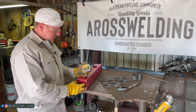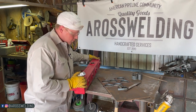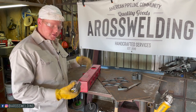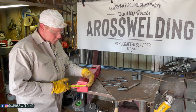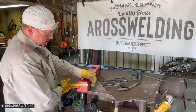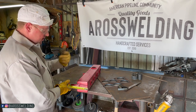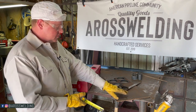But in this case, this is a manifold for a fire truck, and there's gonna be water pressure on it. So I wanna make this airtight and to hold potentially way more pressure than it probably will. To do that, I'm gonna go to my new square tubing over there and take a measurement, probably from outside to inside, which should give me center to center of my wall thickness. We'll get a measurement, and then we'll cut two pieces out of this 1/4-inch plate.